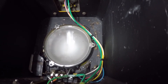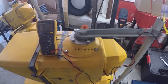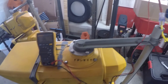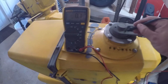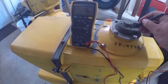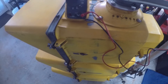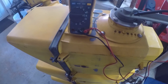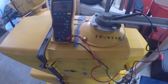We're ready to go ahead and put it the rest of the way back together and turn it on. But real quick before we actually plug this thing in, I just wanted to show you — verifying the ground connection. I got one lead of my meter over in the plug-in there and I'm going to put the other lead at the top of the mounting here. You can see that I have 0.6 ohms, so that means we have good continuity all the way down through the wiring, through the bottom of the light, up through each of those daisy-chain connections I made, up into this top housing right here. So the whole thing is grounded properly and should be safe to have near where people can touch it.